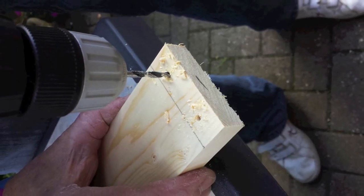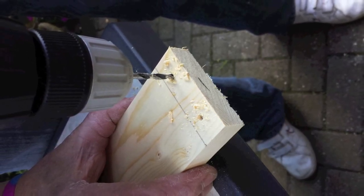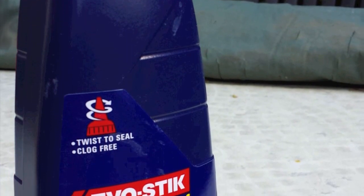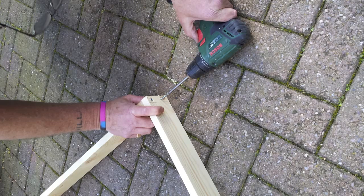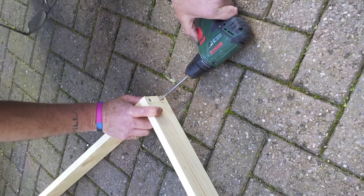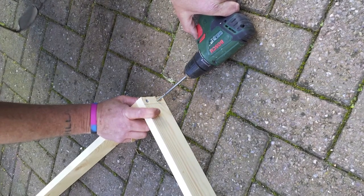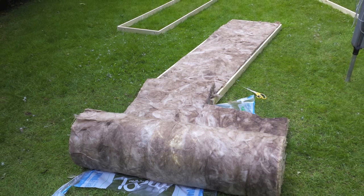There are the baffle boards going into the wall. Now we're moving on to the sound absorption boxes — the other big installation. We drilled holes, used wood glue, and screws in each corner to make sure they stayed square and level and nothing falls apart. I've got three large clouds — sound absorption boxes that go on the roof — and then three sound absorption panels for the walls. They're slightly different: the way we did the roof ones versus the wall ones.